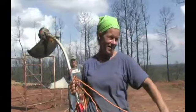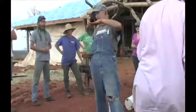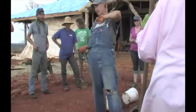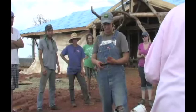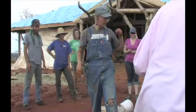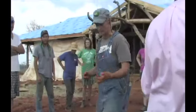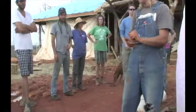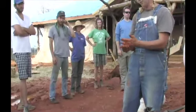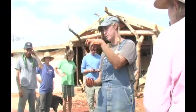Topsoil is really nutrient rich and is good for plants, so we like to keep that for gardening and use the stuff below that isn't as useful. Generally, after you get the topsoil off and you dig something up, I just start playing with it. There are tests — you can send it to a lab and it'll tell you how much clay — or you can do a shake test, which you can find online, which means putting some soil in a jar.